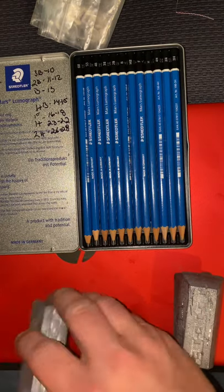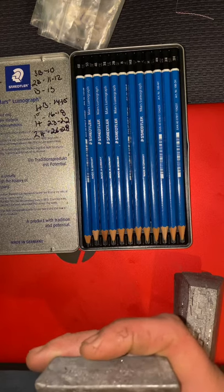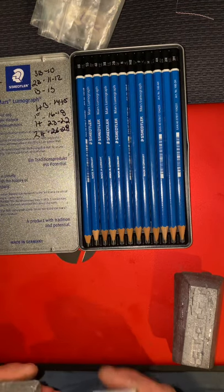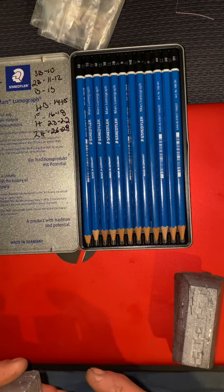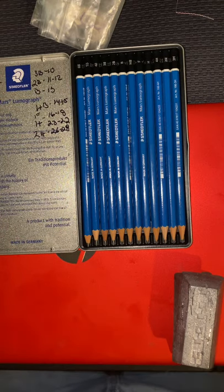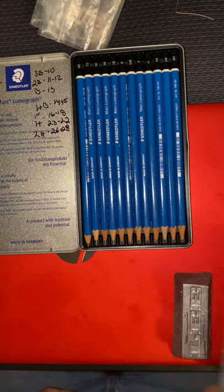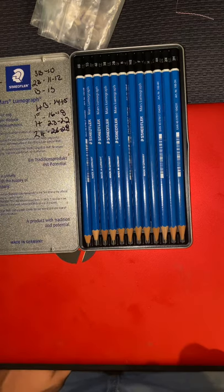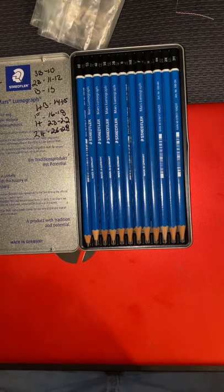Same with that one. This one was 20 to 22 when I checked it the first time, but it's actually harder now — it's been sitting for a couple days, like I was talking about. These were both around 20 before, and now they're harder after sitting three or four days. I test all my stuff, and I can tell when I go to shoot it — the really hard stuff, when it hits steel, the bullet shatters and just leaves a line of shrapnel below the steel. When it's not that hard, it'll leave little pancakes of lead that I can pick up.